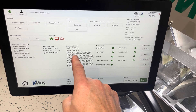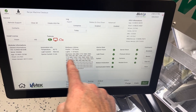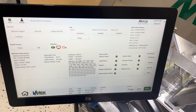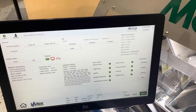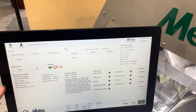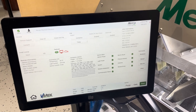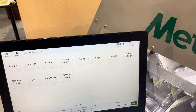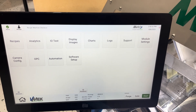Here you can see the amount of time the feeder has been running, how long the lights have been working, and for every ejector how many times it has actually blasted — all for maintenance considerations, PM scheduling, and such. You also have the ability to request remote support if the machine is connected to an internet connection, along with various other improvements to functionality.